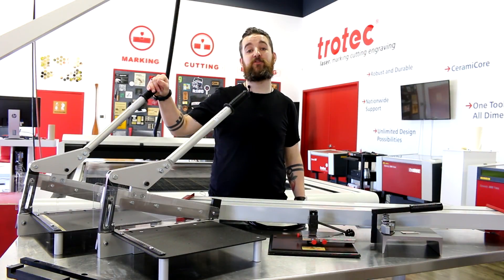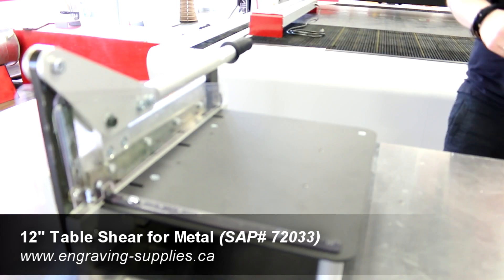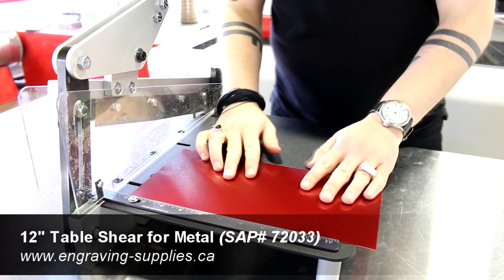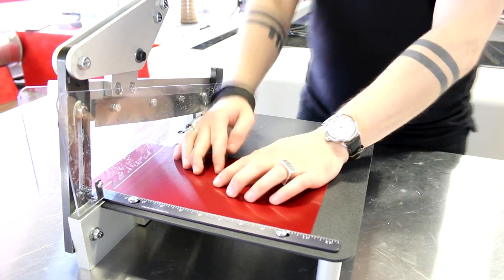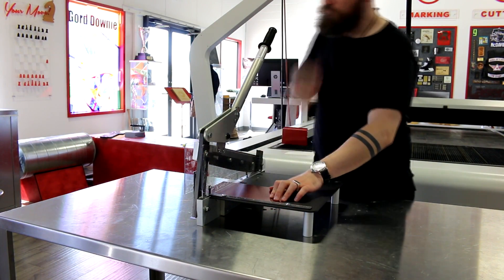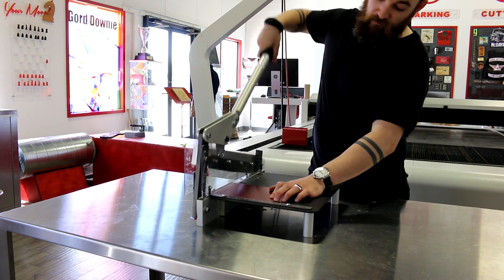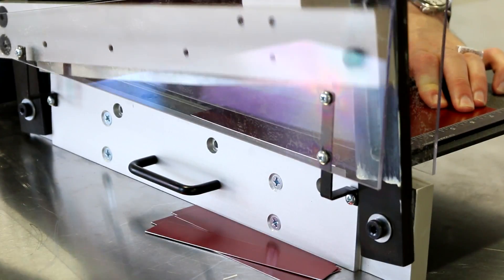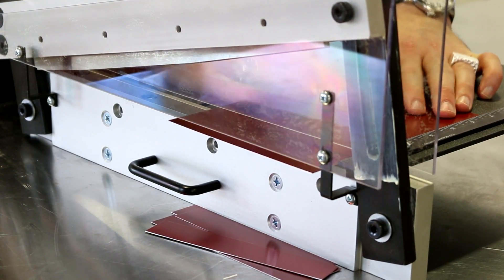Finally, let's look at our Table Shear for Metal. Our Metal Shear cuts aluminum up to 0.04 inches in maximum thickness and trophy brass up to 0.025 inches in maximum thickness. Although it shares all the features of the plastic shear, the plastic blade is acute ground where the metal cutting blade is obtuse ground. Ensure that you specify the material being cut in your shears when ordering, as either the metal or plastic blade is supplied with the machine.